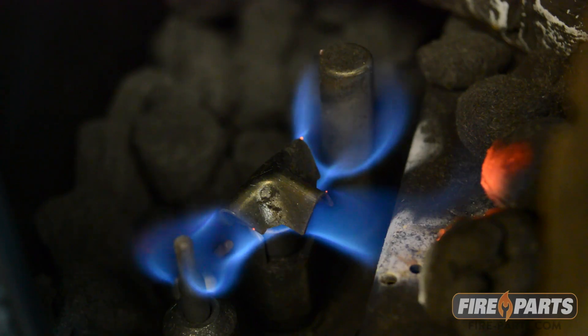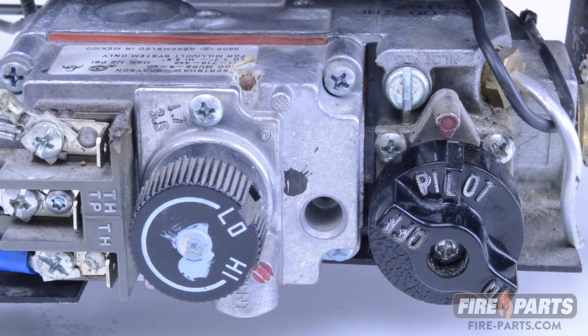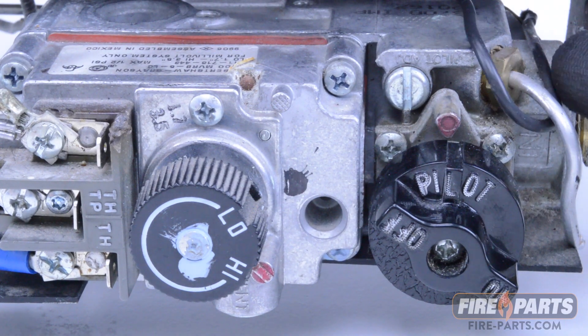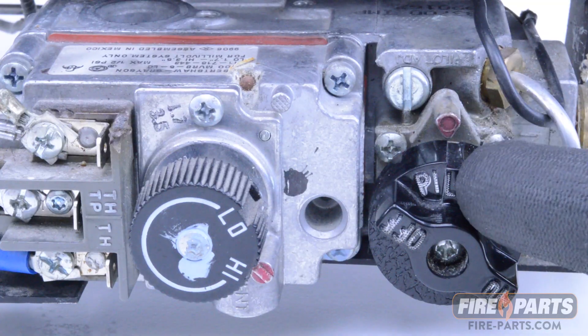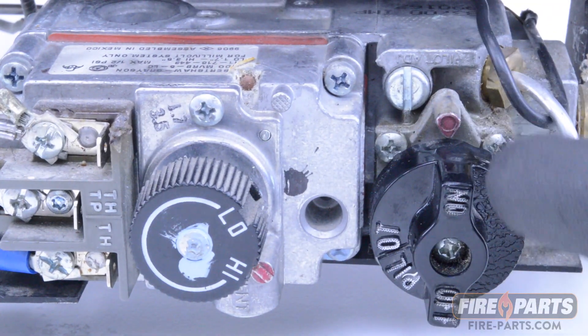For this video, make sure the pilot light is turned on. If the fireplace is not turning on by the switch, a common mistake is that the gas valve has been left in the pilot position. The gas valve must be in the on position for the main burner to light up.